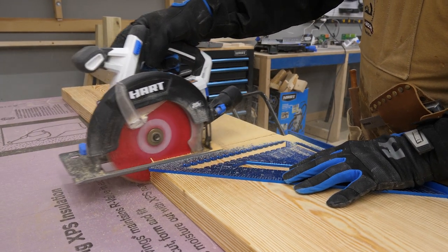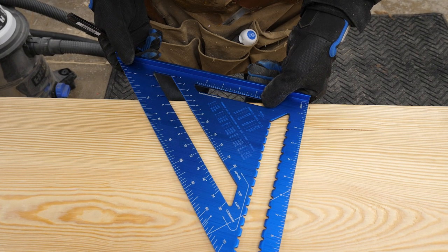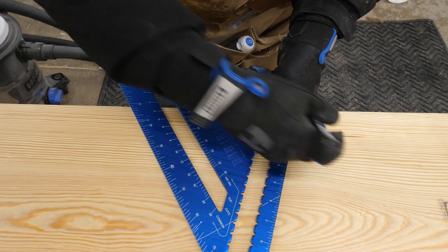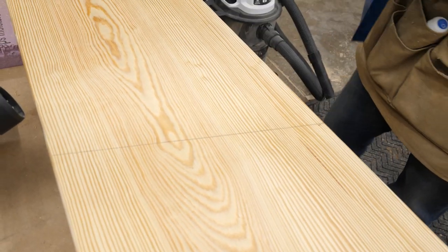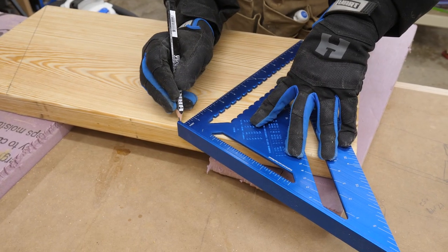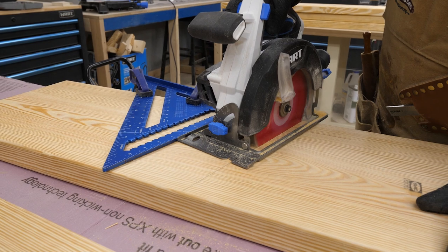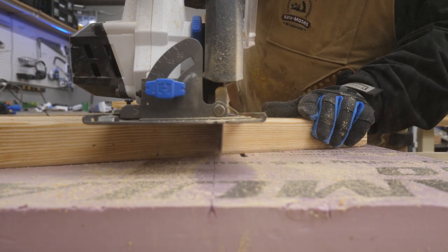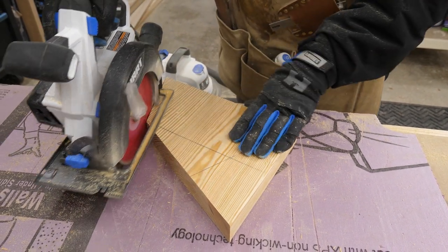The seat, the legs, and the back support all have angles — either 25 or 15 degrees. To mark those, I simply used my square to rotate from my cutting point until the edge of the board lined up with the desired degree. This is incredibly easy, but you want to be as accurate as you can so the pieces go together in the end. Then it was more cutting — the back support was a little more complex, but with a steady hand and patience I was able to cut it out.